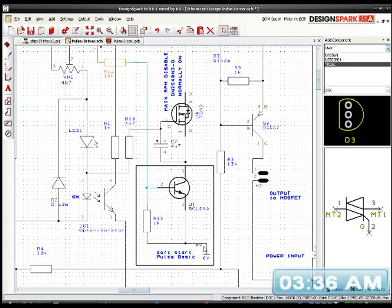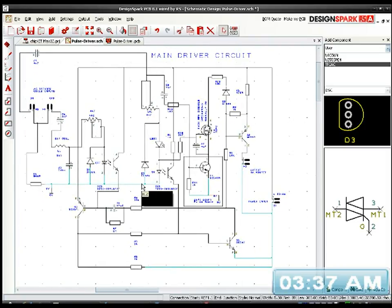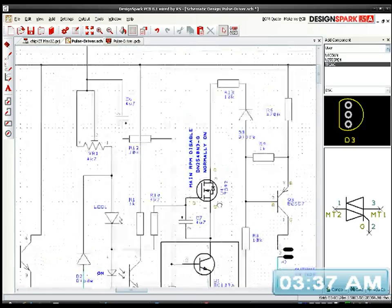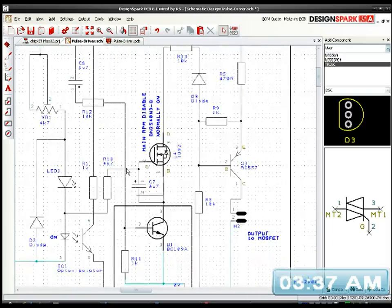So if I click on my 0 volts and just highlight that net again, right? So that's my ground in blue, and you can see it's all over there. The AC ground is also in blue right now. So it's all common ground. So yeah, I haven't really missed anything out. I thought I had actually, but I had to think a minute. But it's going to get its own DC signal, its own AC signal. So I don't really need to bias that.